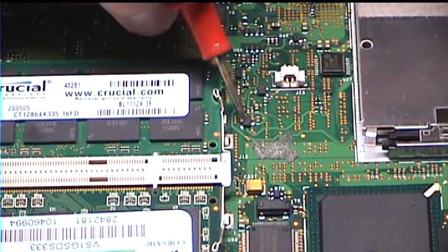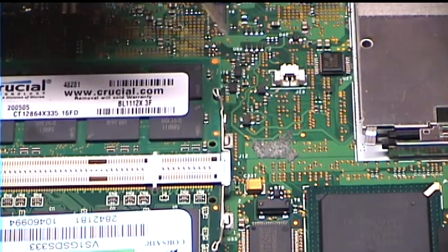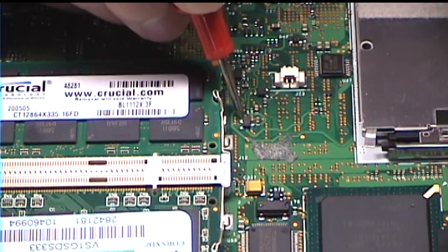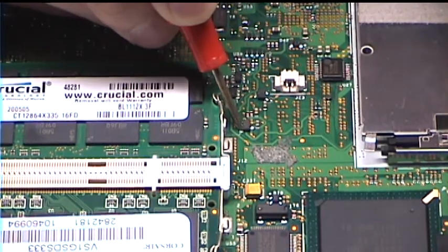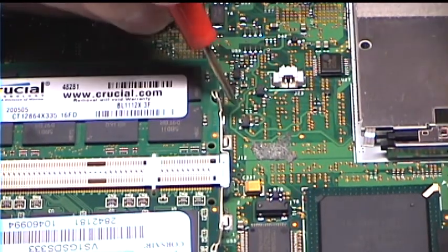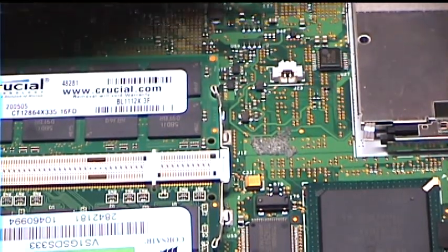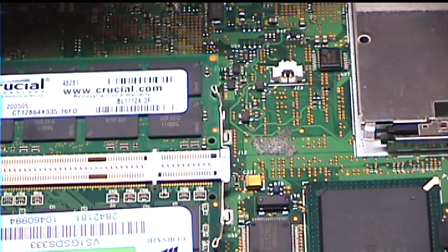And here is the other diode. So this one should have the VCC3M line on one of its pins. I'll show you a better close-up if needed. And you can't see the multimeter, but it's plugged in. But there's nothing there. It's 0 volts. So the VCC3M rail's dead.